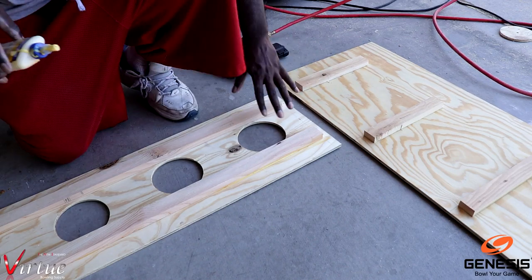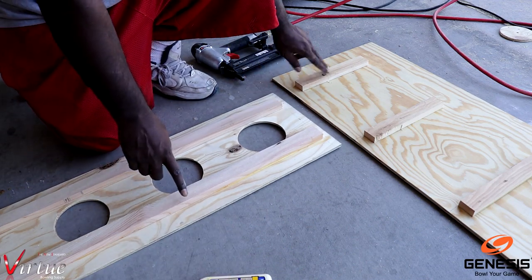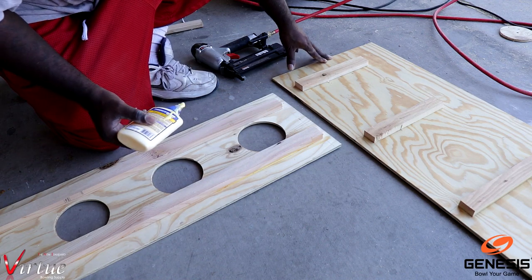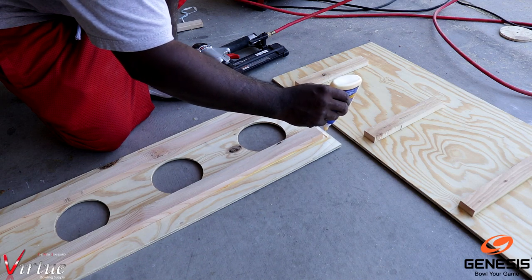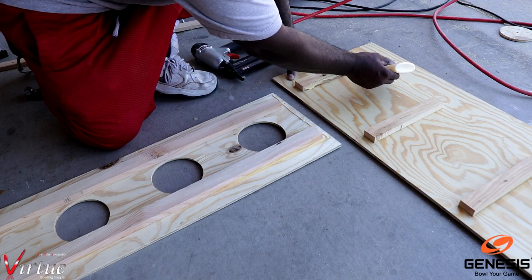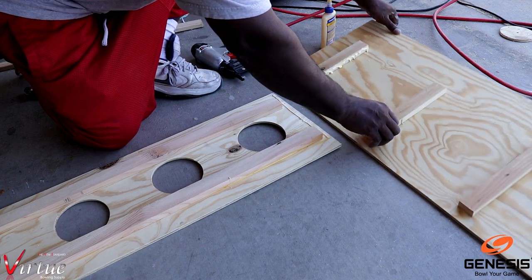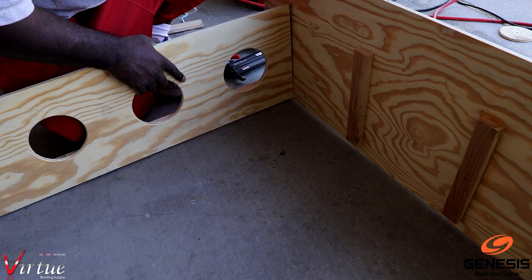Right. Now that you got all your sides together, fun part, the assembly. So this is going to be the bottom shelf. Remember your 3 inches. Any shelf, if you measured it right. Okay. Put glue. Yeah. So here. Just about up to there. Just put glue on your stands there. And because I'm too lazy to go get my clamps and I don't have any help, I'm gonna make this a little bit harder on myself. So just flip it up here, here, and then screw it together like you would.